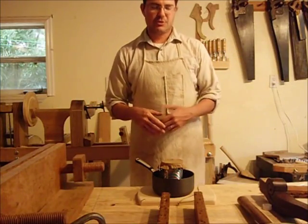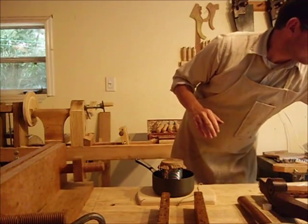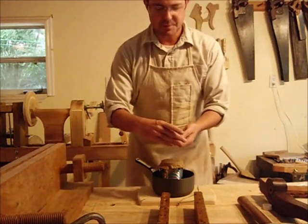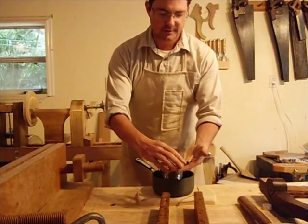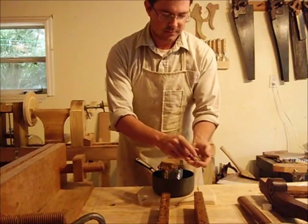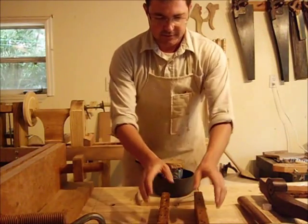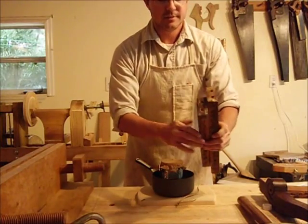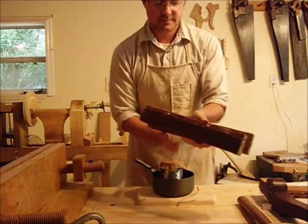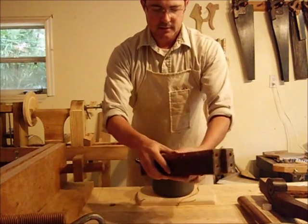Alright, so I've got the joints cut out, and I've got the new joints, or dowels, ready to be glued into the framework. You can see these are oak dowels. And I've cleaned up these joints in here. You can see they've been cut out, cleaned up, ready to go.